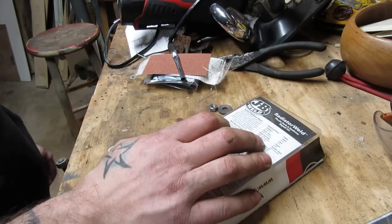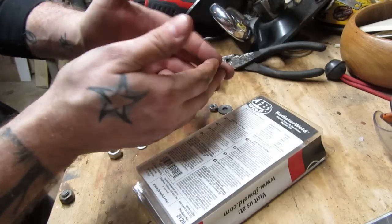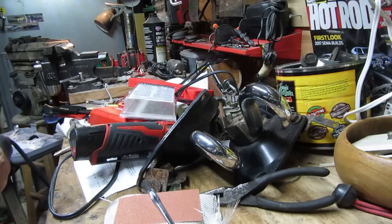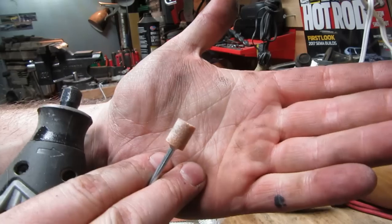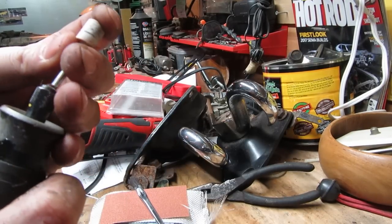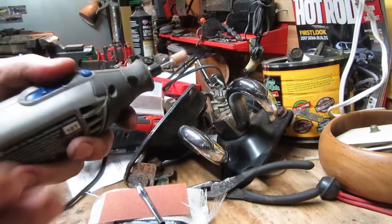Directions say step one is preparation - clean the area well and actually dig into that crack a little bit. Not all the way through, but make a small V along the crack so the JB Weld has somewhere to go inside. I'm going to get the Dremel out with a ball gouge. I'm using a stone bit and going to rough up the whole area, because JB Weld adheres better to a rough surface, and also try to open up that crack a little bit.